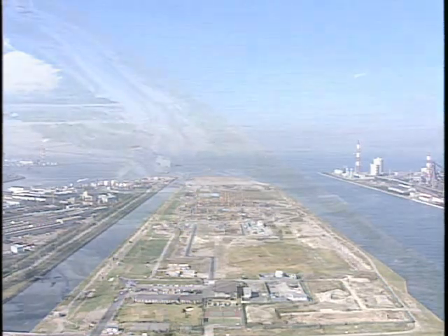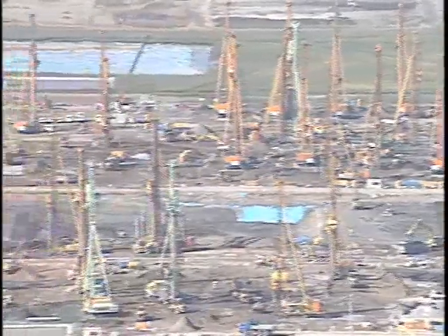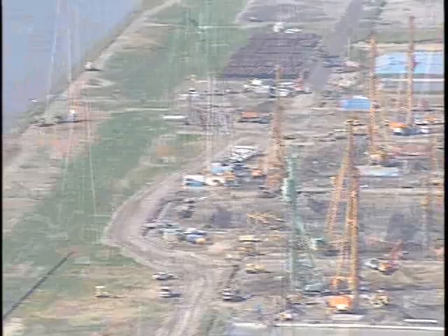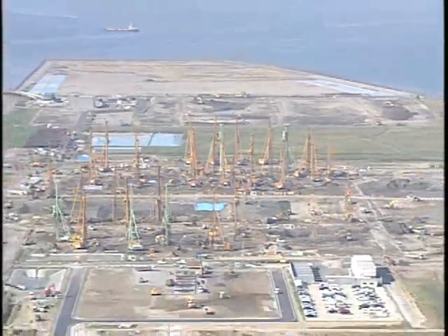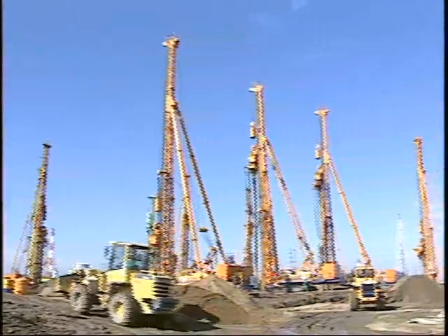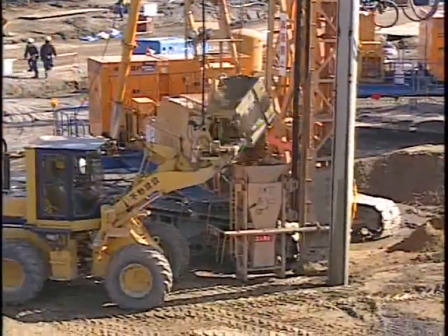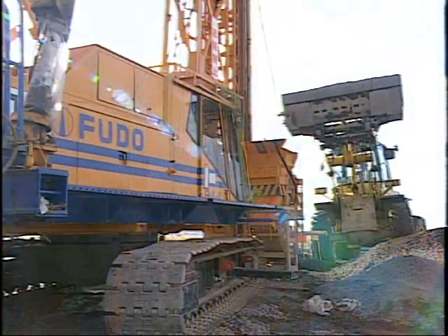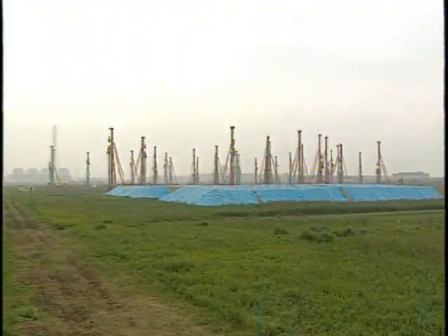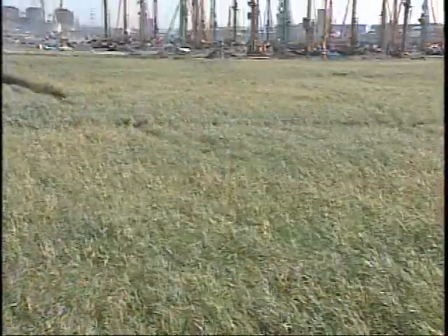The Composer method was designed to stabilize soft ground by forming well-compacted large-diameter sand piles within the ground. It utilizes a re-drive style of implementation, in which a vibrating pipe is repeatedly driven into the ground, withdrawn, and driven down again. Fudo Construction has led the world in the development and commercial application of this method since 1956, and it is currently the most widely used method of ground improvement. Its use has spread around the globe to a total implementation length that now exceeds 350 million meters. It is a method that has rewritten the history of ground improvement.